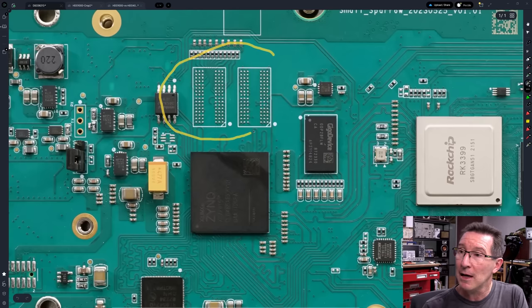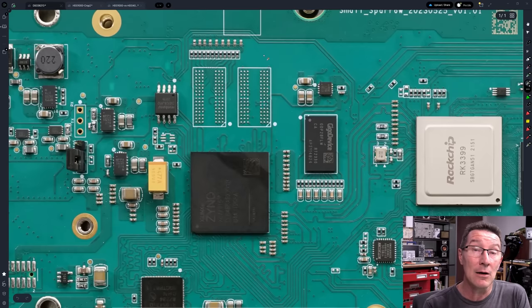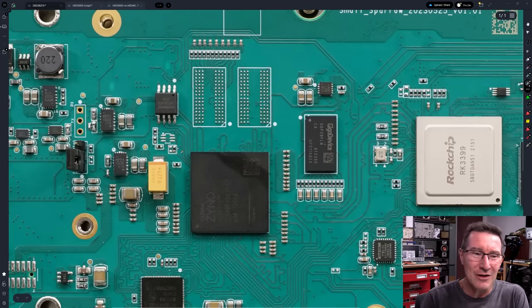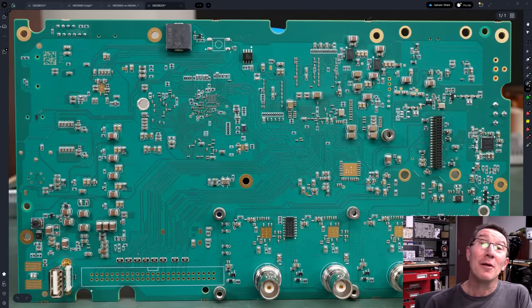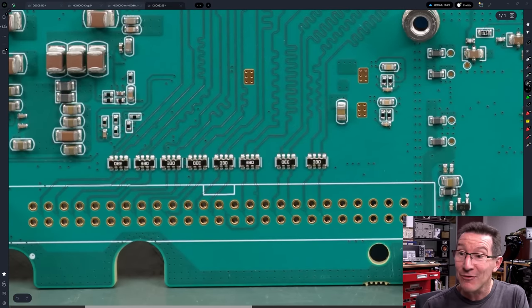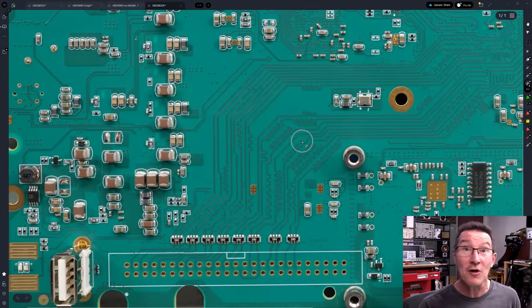I've got some memory missing here. The 900 model has more sample memory and has the logic analyzer option. If you're going to try to hack this to include the logic analyzer, you might have to install those chips. Interestingly, they've populated the termination resistors here — why would you not just simply remove those from your bill of materials if you're not using them? All the production time adds up. It's almost as if — conspiracy theory — they want you to hack this thing, but you'd have to dremel out a hole in the front case.